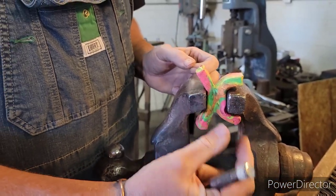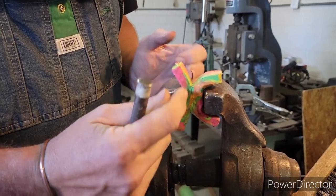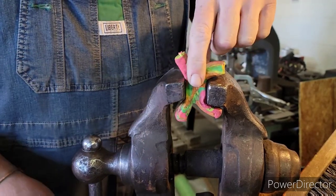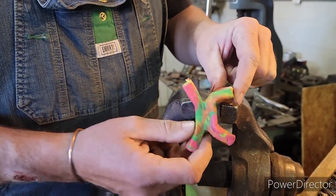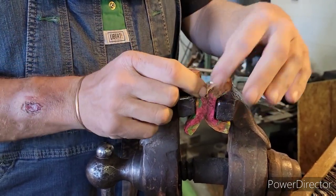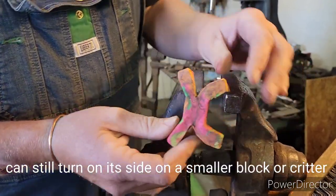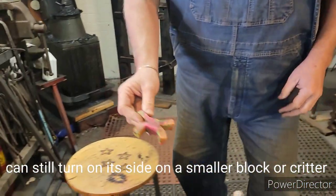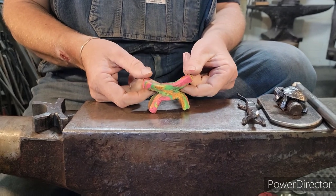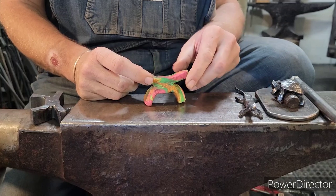You might measure your vice jaws — you might change this body width or size to match the depth of a jaw, unless you've got another way you're going to do it. But that is pretty handy for it to fit in there to work on, whether it's the head or feet. It's nice to be able to fit this in your vice. Coming back over here, what we've got is we've spread these out, we've fullered it — this can be our tail section, this we can call our head section.